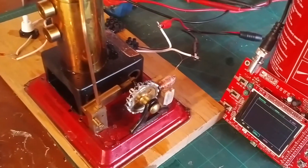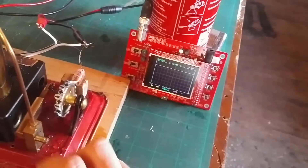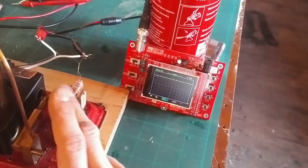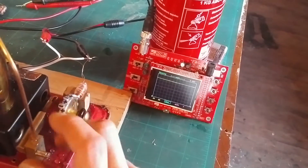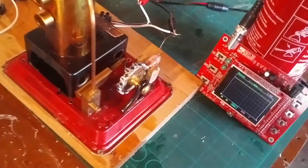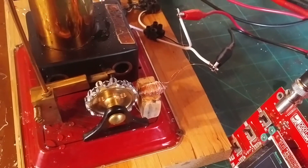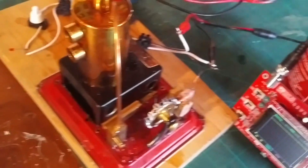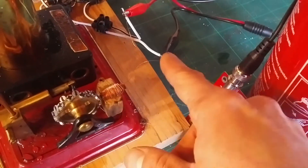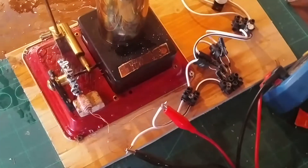I added more magnets and put plus/minus labels so you can see. Now watch the oscilloscope — the sine wave seems to be working. I also changed the coil: the first one I made was this old coil, but I made a new one with thinner wire and a lot more windings, which gave me quite a bit more power out. It's still very very little — I can't even measure the AC exactly, but I think it's about 0.5 volts AC coming out.